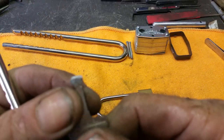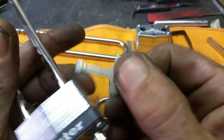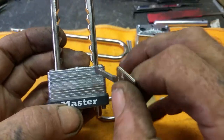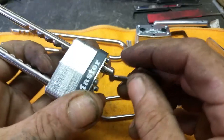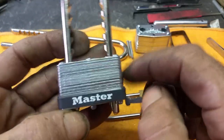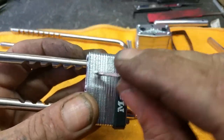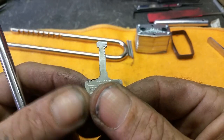So that would basically open all the padlocks on the 517 series, really, because the locking pole is in the same position on both of these locks. So I'm assuming they're all the same position on all 517 series padlocks. Just a matter of having different warding plates in different positions to suit the key.